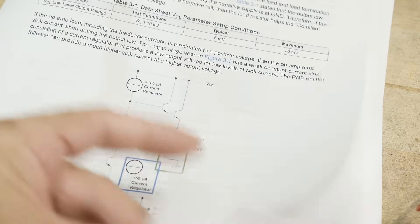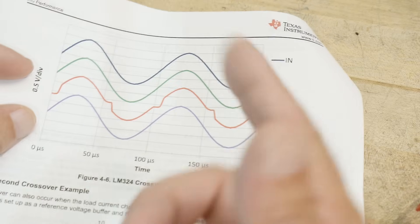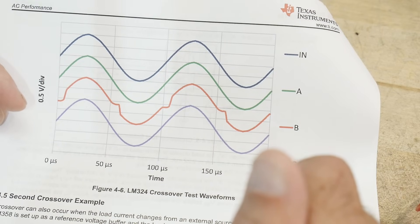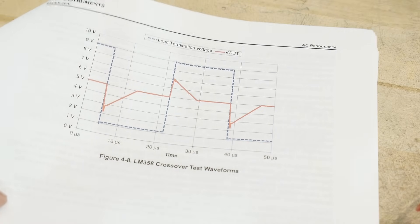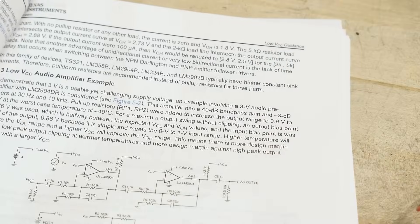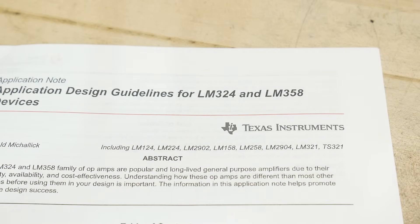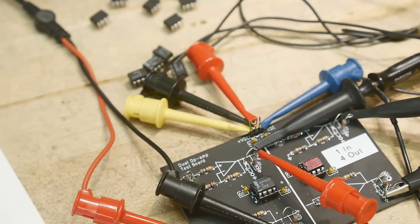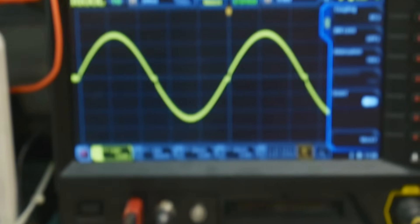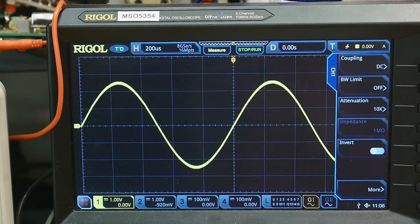It's a very weird op amp in that respect. If I had ever learned this back in the past, I would have immediately recognized that waveform and said those op amps are LM358s. But I just never went down this road before. There are probably some other quirks too - delay through the part and other issues. Definitely quirks about the LM358 and also the LM324.